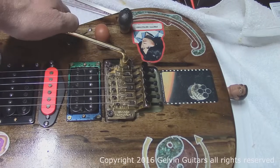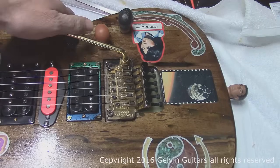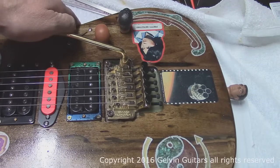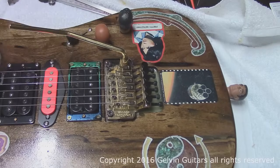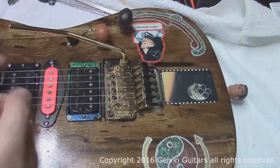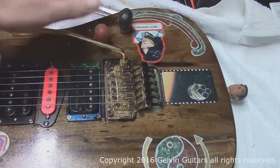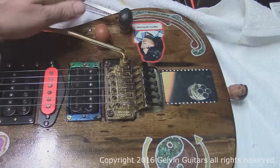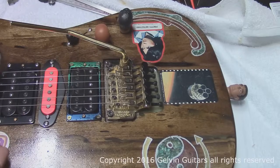Now, looking at mine, I can tell that I have to release the spring just a little bit. And when I say just a little bit, we're talking a quarter of a turn on only one of the screws. That might be more than enough. You don't want to be sitting there trying to do 15 turns on the screw and releasing a lot of it. Just a quarter of a turn, test it, quarter of a turn, test it. And you keep doing that until you find equilibrium. As soon as you find equilibrium, you'll never really have to adjust it again,